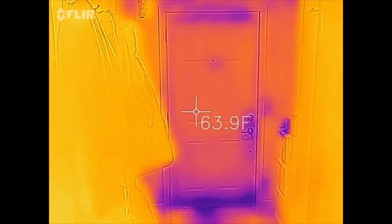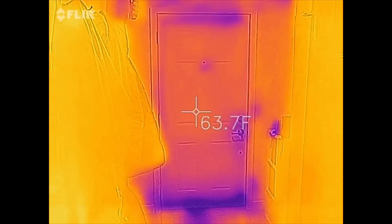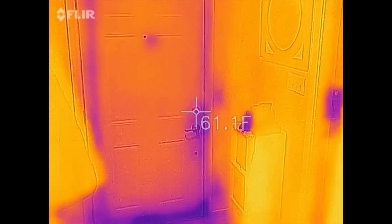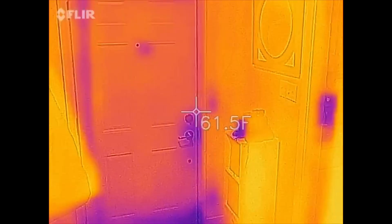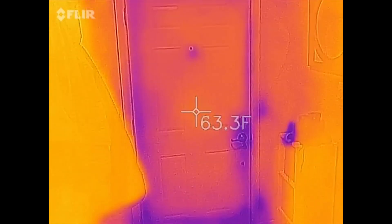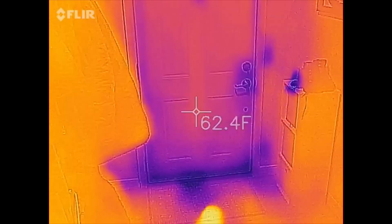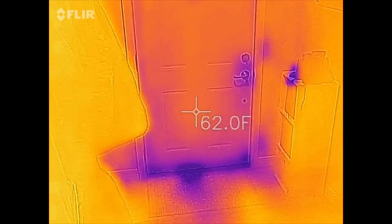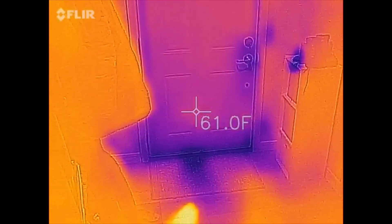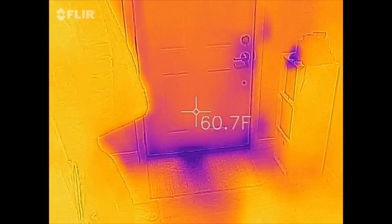So you can see this is my front door. Around the top of the door there's a little bit of purple indicating a cooler section. You can see the deadbolt and the doorknob there, but right inside the wall there's a cool spot. Also around the peephole it's a little cooler. But the big thing I noticed was this dark purple spot right here — that indicates there's some air leaking in because you can see how it's trailing all the way out on the floor. So I'm gonna get a look at that and see if I can fix it.